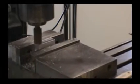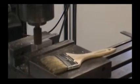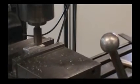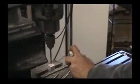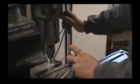First I'm making a fixture. I found a piece of aluminum that is one by one by two inches long and I'm squaring it up, holding it one inch on all sides. I'm trying to make it as square as I possibly can. I'm going to use this to hold the cutter to machine it. I measure directly into the middle of the piece and I'm going to drill a hole clear through it and then ream the hole.